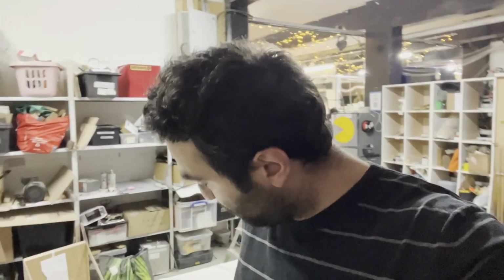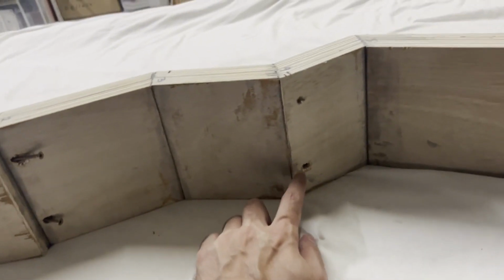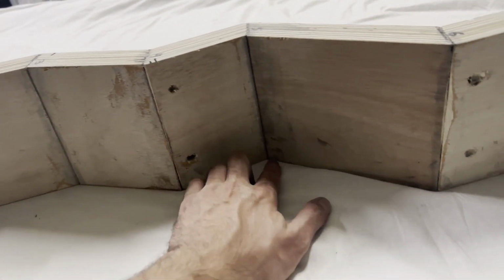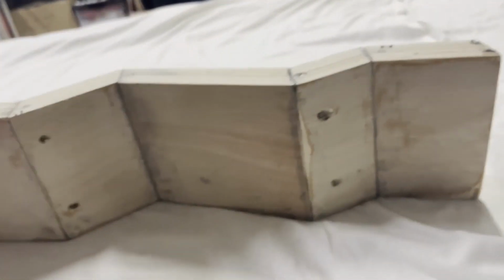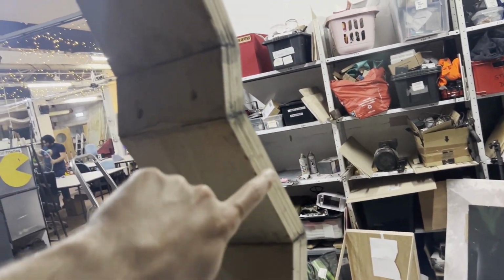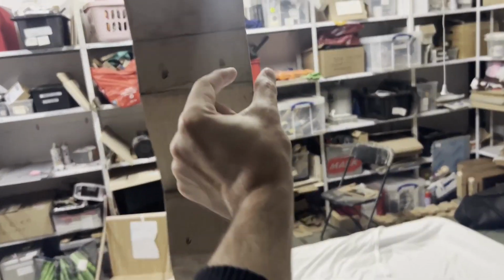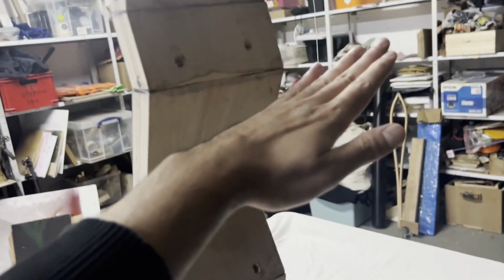This thing is dried, however there is a problem. Basically the surface of this is straight up until around here. After this bit it actually gets bent over a tiny bit, so it's creating this bendy surface, rather. There is a gap literally over here when I put it. When this is straight like this, there is a gap in here like that, because this is not aligned perfectly. So what I'm thinking is to chop this from here, get the screws undone, shave this bit to make it a bit further down like that, and then glue it again.